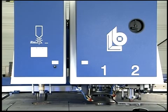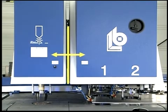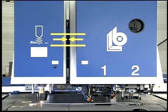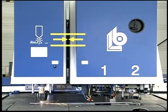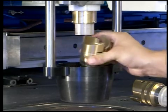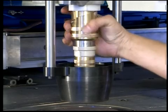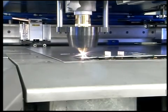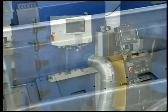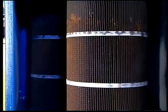A roller tool can be used with all CombiCut models. The plasma burner is mounted next to the punching unit. To avoid transmission of vibrations, the plasma unit is pneumatically disconnected from the punching unit during the punching operation. As soon as the burner is used, the plasma unit is firmly connected to the punching unit via two cylinders. To avoid long periods of downtime, a quick change burner with bayonet fixing is available, guaranteeing fast changeover for varying cutting tasks. A chute for small parts up to 500 by 500 millimeters near the plasma burner ensures removal of the cut parts. An effective suction and efficient filter system ensure safe removal of cutting residue during plasma cutting.